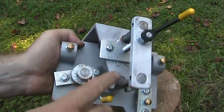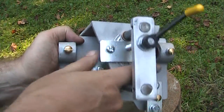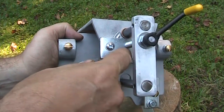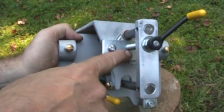The one weakness is right here where this drive rod goes through — it goes through aluminum. I added this steel plate; this isn't part of the regular assembly. I threaded a hole there and this gives it some added strength and it's also going to wear a lot longer.